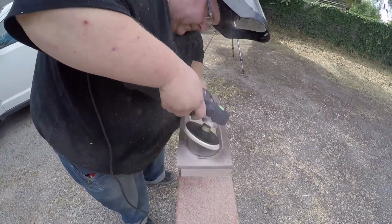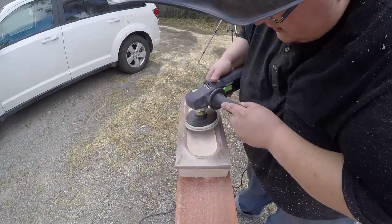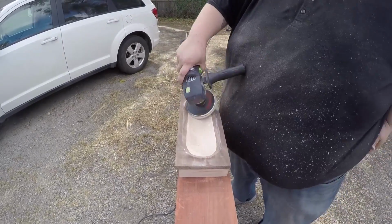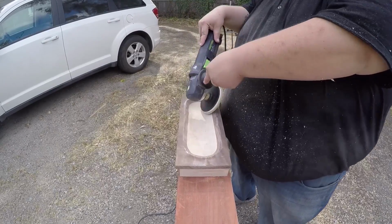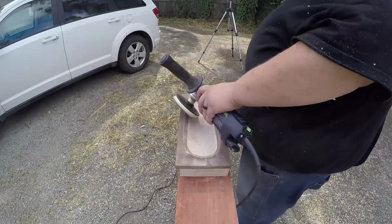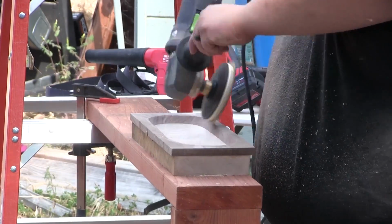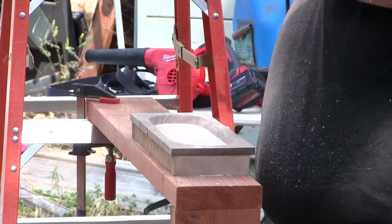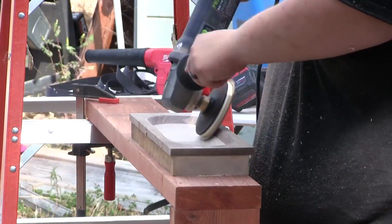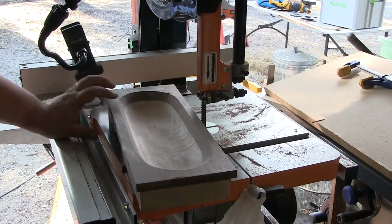And here you can see I'm smoothing everything out with the Festool RAS 115 sander with 40 grit paper on the wheel. The funny thing is this is the wheel that I shredded in my last video, and so it's actually a lot smaller than the sandpaper discs, but I'm using that to my advantage here because it allows the sandpaper to wrap over the edge of the wheel. While this wasn't super handy for my last project, which was a convex form with very delineated lines, for this bowl shape or concave form, it was really, really helpful. And for more convex work in the future, I have a replacement pad that's hard, which won't shred so easily, and I also know not to run it up against sharp edges like I did with this one. I think that was a little beyond the scope of use.